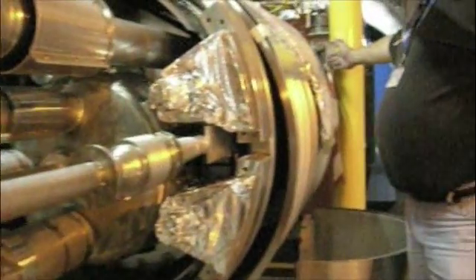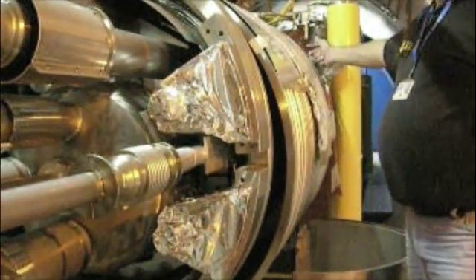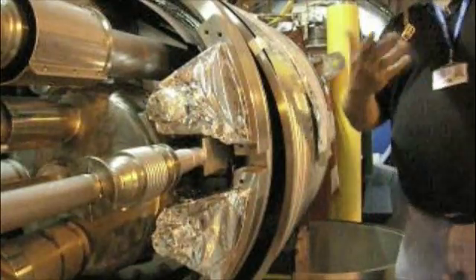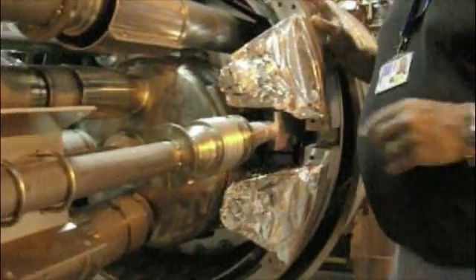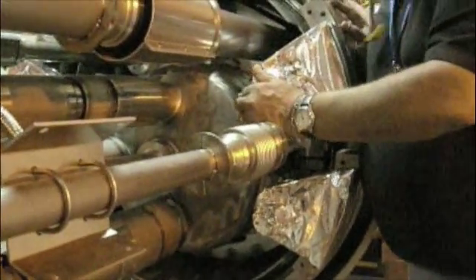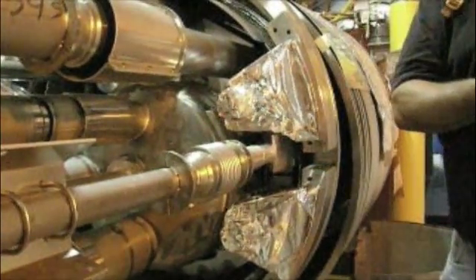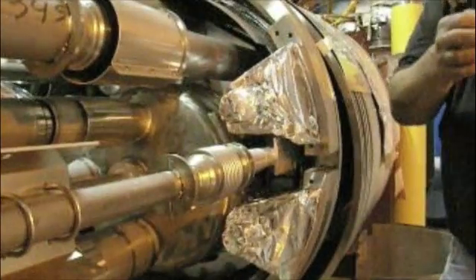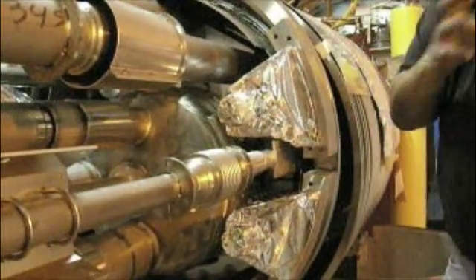So this point stays at the same place — this is the so-called fixed point. But instead of really being fixed, it's a virtual fixed point. At the same time, this is so strong that there's no force on this composite ring. In fact, we release the composite ring so it can freely slide back and forth. It's not fixed anymore.